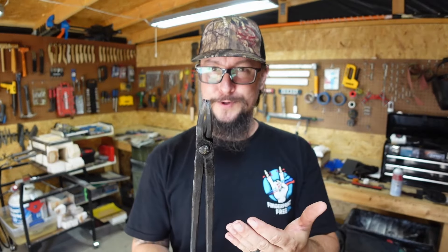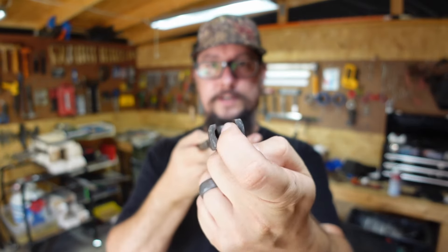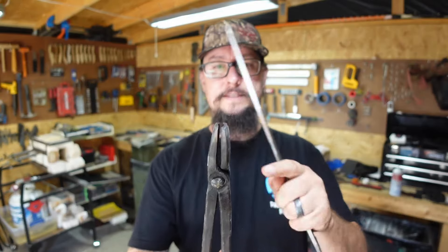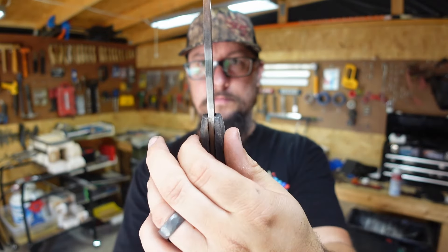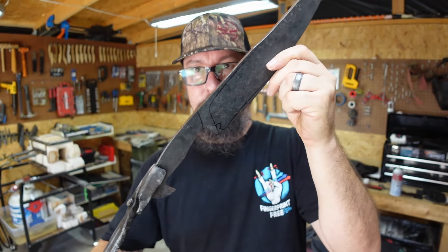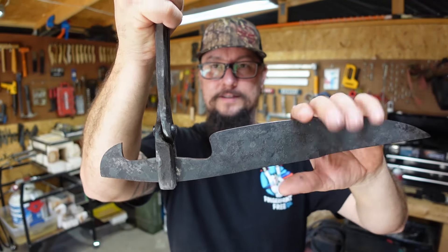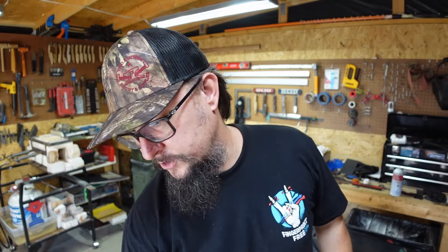There are other tongs that are a little bit better. These ones I use a whole lot — I can use them for several different things, not just holding flat stock but also round bar, because they have a little round section inside. They have a narrower jaw opening, so you get more contact and it's not going to move as much. Still not preferred though, because people end up holding them awkwardly to keep the steel from popping up, which is very uncomfortable when you're trying to hammer.